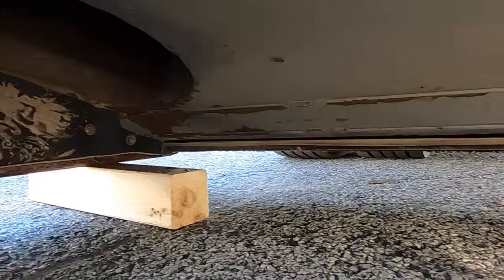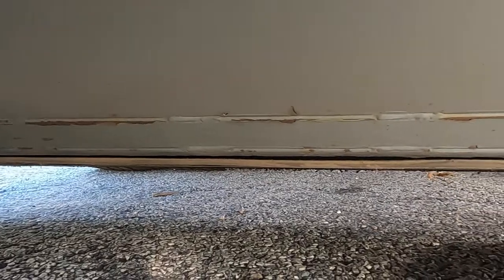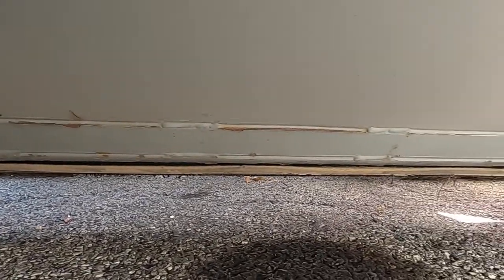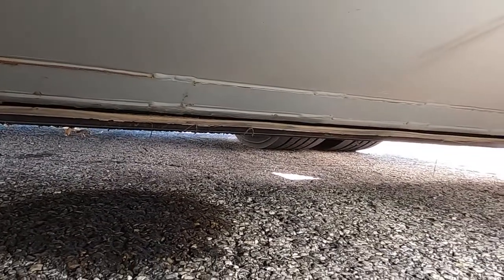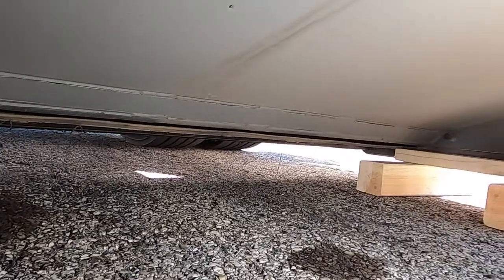While you're there, check the width of the pressure slot. It should be even across the head, half an inch wide. Verify that the pressure slot rubber is in good shape — damage to that can cause trailing. Inspect the whole pressure slot for damage or bent components.